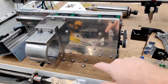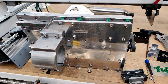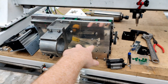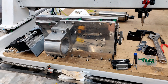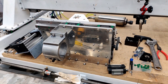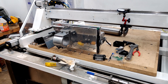In order to put the pocket in for the new ball screw, I'll have to mill it out, and obviously I need to figure out how to do that without having this plate on there. What I'll do is make this same plate out of plywood on the CNC — a one-time use thing — so I can put the plywood piece in, mill out the pocket on the aluminum one, and then swap them back. It's a bit of a puzzle upgrading the machine with the machine, but sometimes you need temporary solutions like that.